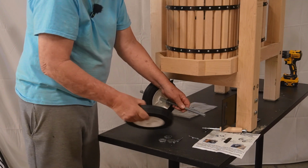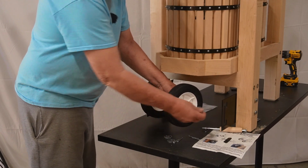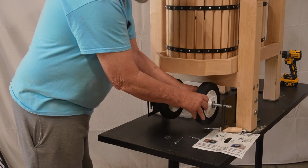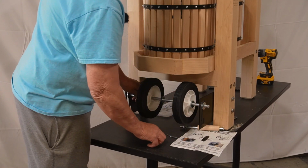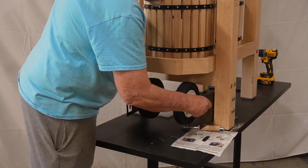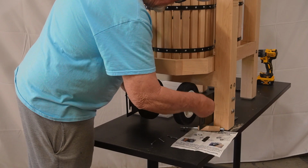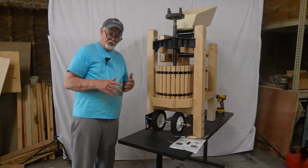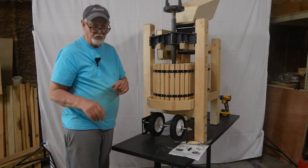Now take your next wheel, long side out, 2 washers, slide it into your groove on your other plate, washer, cotter key into the second hole. You don't drop it like I do. This system is set up for different applications, so you'll get more parts than you need. On this one, you should have 2 cotter keys left over.